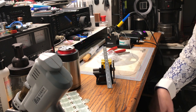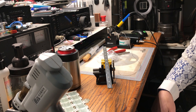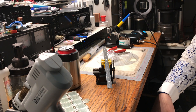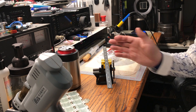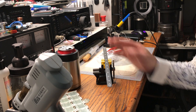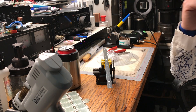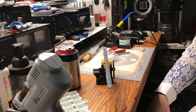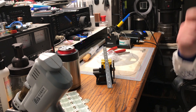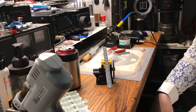As for the boards, after I clean them up I might get a small ultrasonic cleaner to clean off all the flux and residue. Then I'm going to conformal coat all of these boards — it's a special spray where you spray the boards down, let it tack up a little bit, then spray in a different direction. That should seal them up nearly 100% and make them pretty weatherproof, even though water will eventually get in anyway over time.